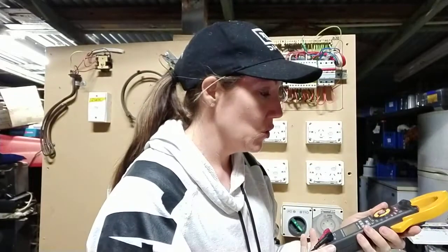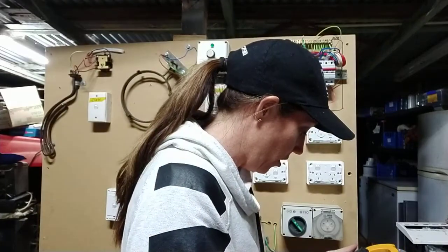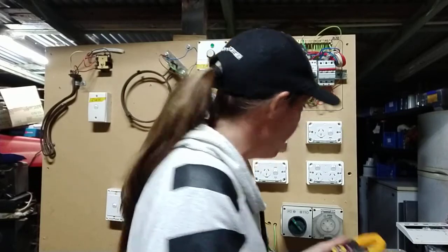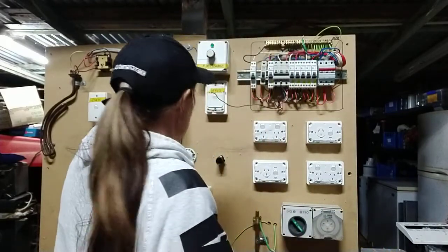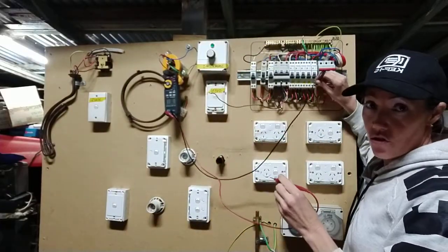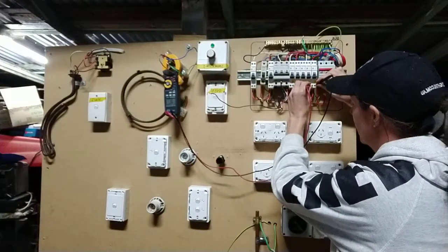How do we test it with the multimeter? Make sure you've tested your tester and zeroed it. Using the small scales again — no more than 20 ohms — so go one ohm, three ohm, 20 ohm. You're looking for continuity, because you want to see if any of these are mixed up in your circuit somehow. The way to do it is you start at your first neutral and then you move to your second neutral.